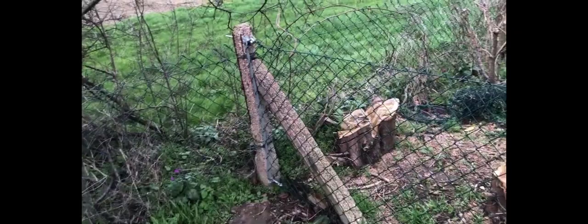You can see the old bracket arrangement there. So what you're supposed to do is first of all get the top and bottom wire tensioned up — that's where the tension is. You're not actually supposed to tension these middle posts at all because they haven't got any support. If you look at the corner post, that has got this kind of diagonal support to counter the tension in the wires — that's how it's supposed to work.